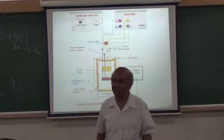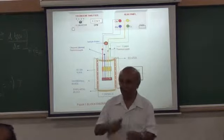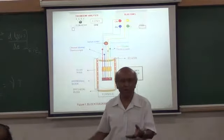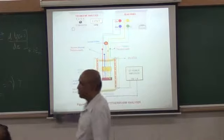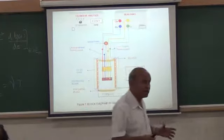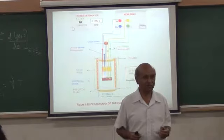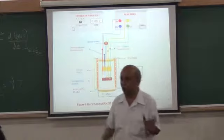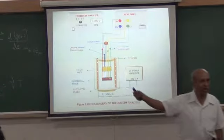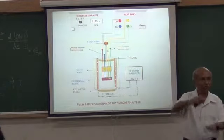What is difficult about it? But you have to get the right material. So get an alumina tube, you must get this blanket, and then put about a 10 to 15 ohm or 20 ohm resistor. Then have a power source which you always have in your laboratory. I'm going to use one of them, which is there. Then when it is well insulated, you can get about 600 to 800 degrees inside the center of this. More than sufficient for all your college experiments. You can do this experiment. I will show you the construction. It was all built in my laboratory, a small furnace, just about this much height.